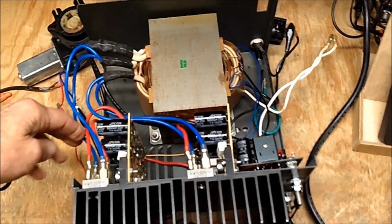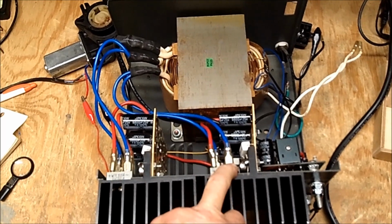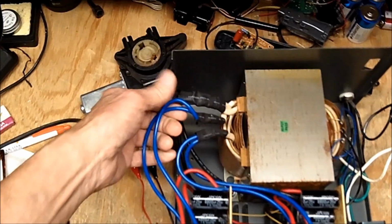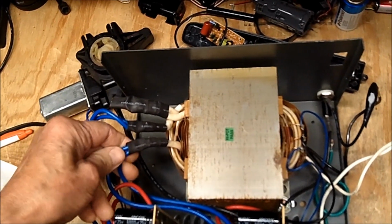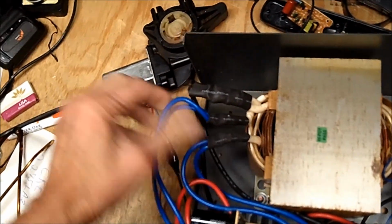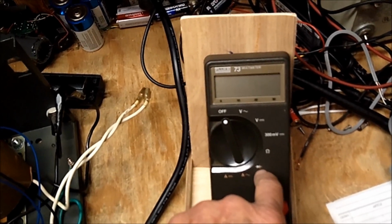But I'm getting AC voltage on these lines, these diodes, which are not bridge. I found that out. They are just two diodes in parallel in each one, and using double the AC coming in. And these two leads here are just tied together because of the heavy current. The wiring is doubled up. Same with this side. So between here and here, I think it's like 34 volts or something like that. And this is the common. So the diodes check good using my diode test.